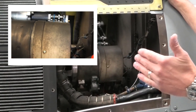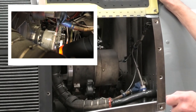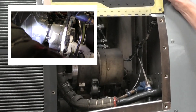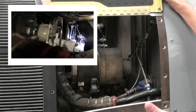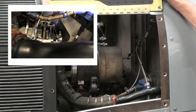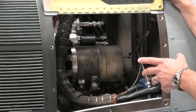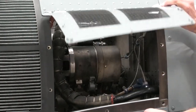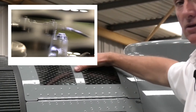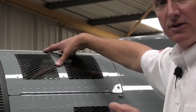Moving forward, we look at the rotor brake: the disc assembly, the calipers — there are two — and we check the brake pads to see that there's enough meat on them. We then look at the freewheel area, checking for any oil leaks, and at the bottom of the engine deck again looking for oil leaks. We look at the engine mount on this side and check the three mounting points for integrity. Coming upwards, we check the starter generator and the integrity of the hardware. On the top we have two bypasses — one for the oil system, one for the fuel system — and the inset shows that they both have the red pins retracted, which means the filters are not bypassing.